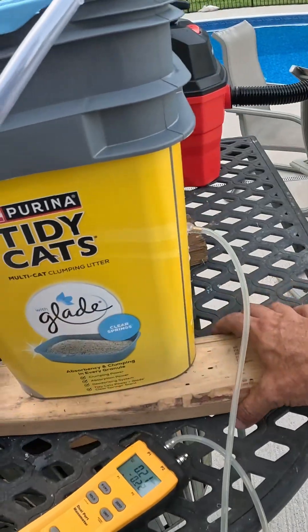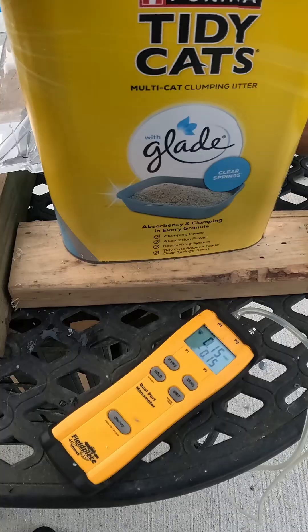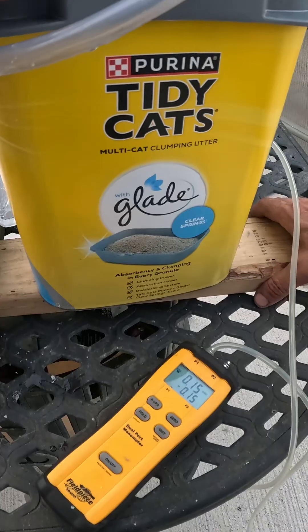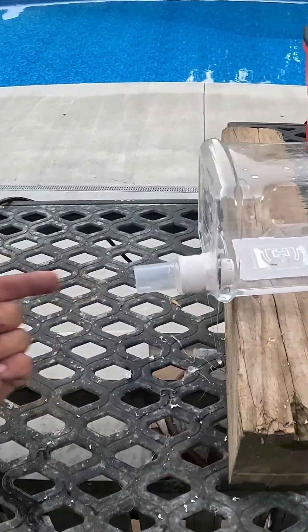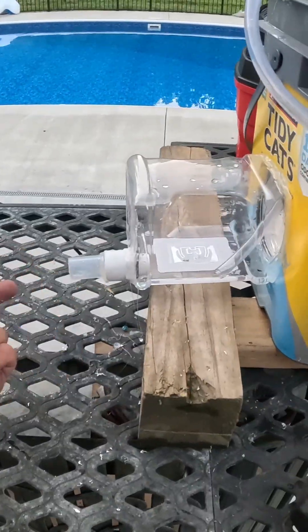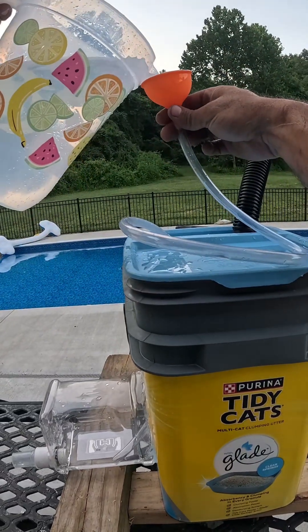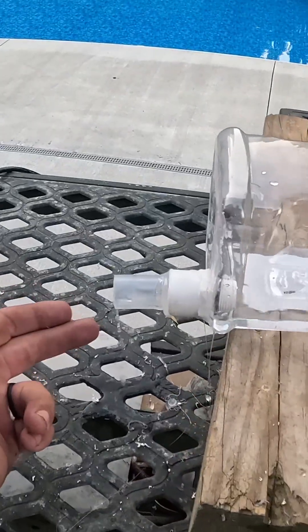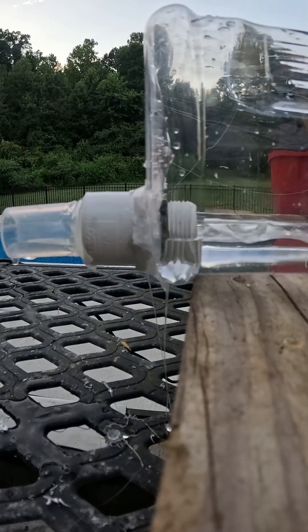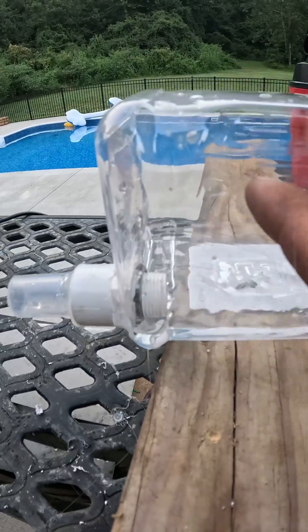We need to move our boards over a little bit — point one. We can move our boards in and out and reduce that a little bit. Let's say the filter is really dirty — probably going to see a point two. So as this is under negative pressure, air is rushing in this way. When we don't have a trap here we have air coming in. As I add more water this simulates the air conditioner running and making more water. The water level is well above where it would normally run out on its own.